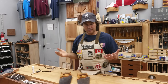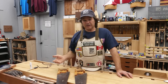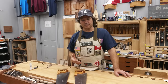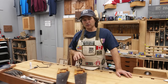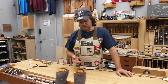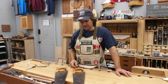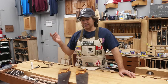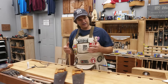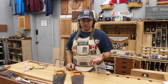Before power tools literally took over all sawing operations, a woodworker would have multiple hand saws — six, maybe as many as twelve — for different operations, and they would store these in a case or a box called a saw till. Most hybrid woodworkers today, that's woodworkers using both hand tools and power tools, need one or two — I think you need at least two: a cross-cut and a rip — and you want some way to conveniently store them other than just hanging them on a nail.